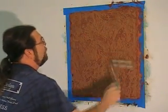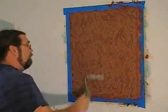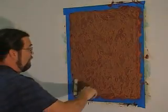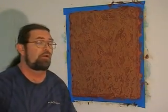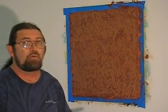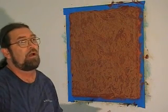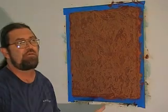One thing you need to know about water-based clears is if you're going over a dark surface and you put it on real thick, it's going to cloud it. It's a real simple finish, and it's cost effective. You can get it done quickly on a niche. Total time, I probably got maybe 3 hours into the niche, maybe 4.